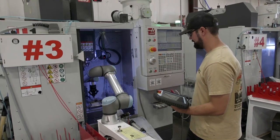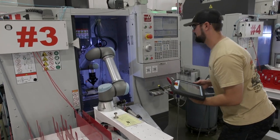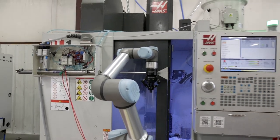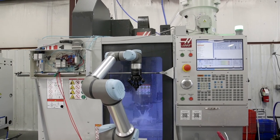The UR robot comes with additional IOs, which allows you to control auxiliary systems through the robot program. To integrate it with the Haas, it's literally just a few wires and a couple of relays and some lines of code in your part programs. That functionality in the robot let us do a lot more really quickly without having to invest in a bunch of sensors and other systems that would also have reliability issues.